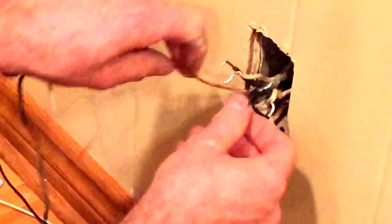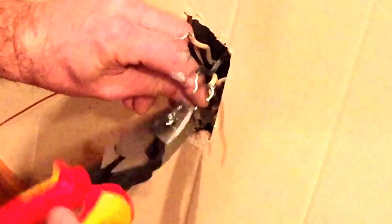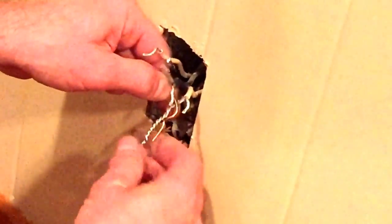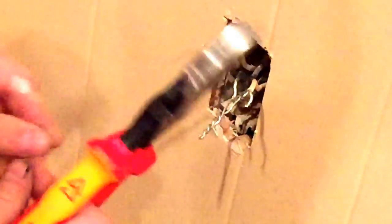For the neutral, I'm going to use a lighter-gauge copper pigtail — you want to use the gauge that matches the 12-gauge aluminum. This is actually 14-gauge copper, which is what matches the aluminum. One problem here: if you notice, this gets over-twisted. A lot of times aluminum, when you start twisting it too much, becomes brittle and breaks. That's another issue with aluminum — this has been twisted way too much, so we're going to back that off a little bit.